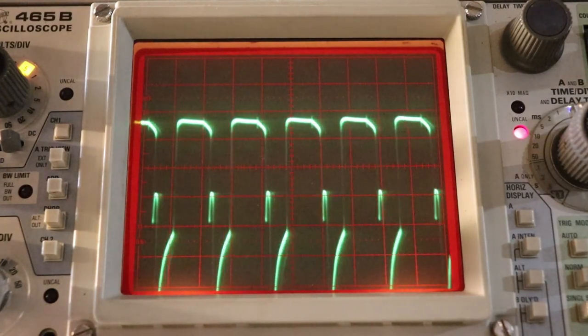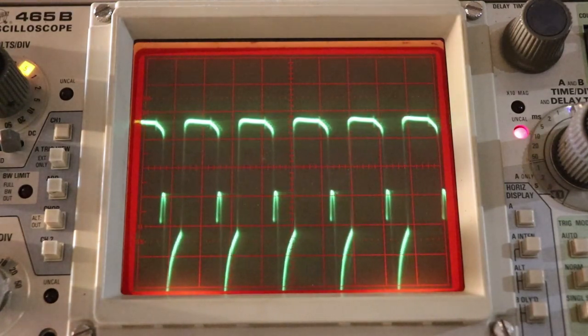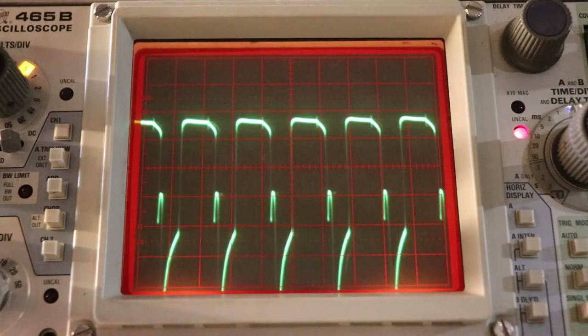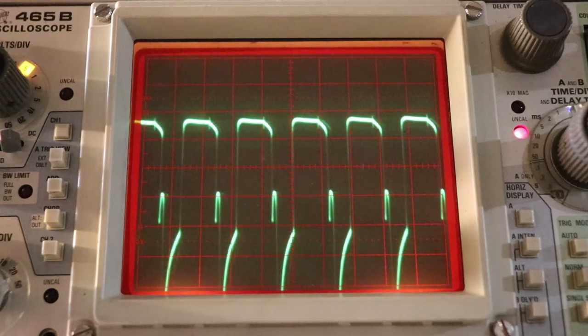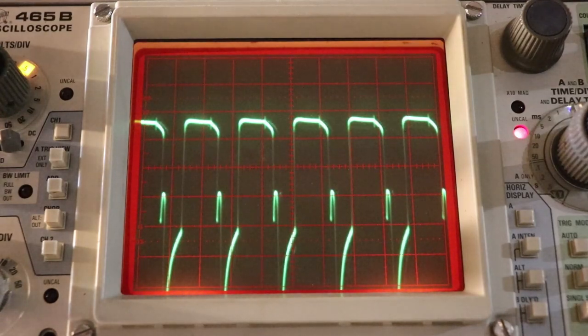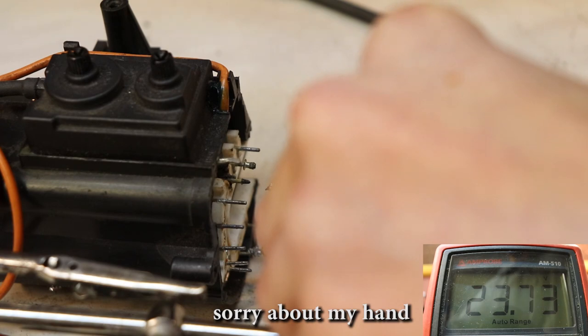But I'm also starting to think that the designers for this circuit intentionally made it this way so the transistor doesn't turn on too much and destroy itself from, you know, switching high current. So maybe this switching waveform is intentional, but honestly, I'm not sure. What I'm going to do right now is put some protection circuits on the power transistor, and then we'll test this waveform with the flyback all the way to 120 volts and see if the performance from the flyback is satisfactory.